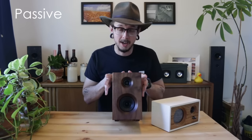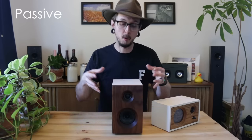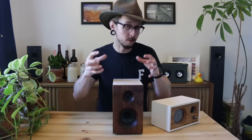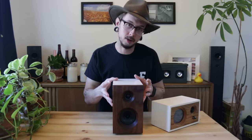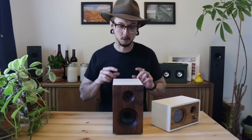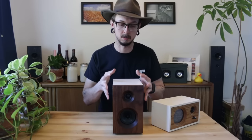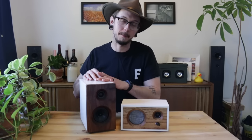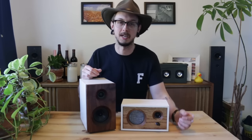So then we have passive speakers. Passive speakers contain no audio amplifier within the enclosure — they only contain the essential parts needed after the amplifier. So in this speaker we have a woofer, a tweeter, a crossover within the enclosure that filters the audio signal, and terminals on the back. Basically all speakers need an audio amp to power the drivers. A powered speaker has that amp within the enclosure; a passive speaker has that amp external from the enclosure.